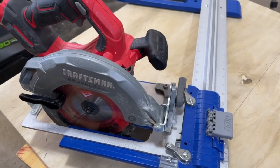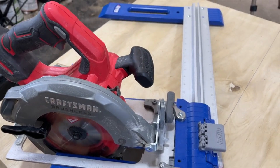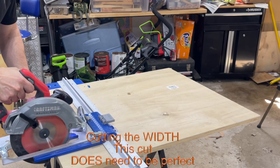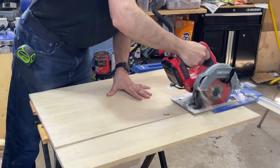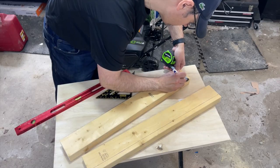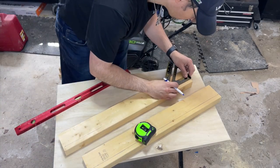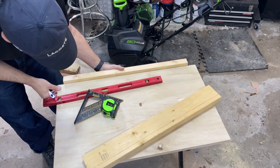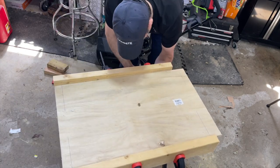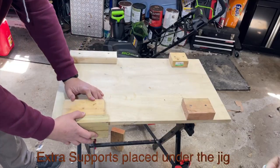The circular saw is placed in the guide, which helps to keep a nice straight cut. You really want this width to be spot on because it helps with the alignment of the entire hive body — top and bottom both. After doing that, you need to attach your side mounts, which are your supports. First I marked about three-quarters of an inch from the top so I knew where to line things up, and then I did some dry fitting with some clamps.